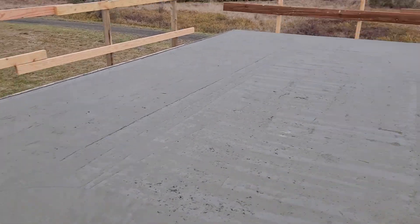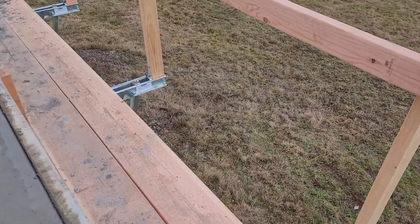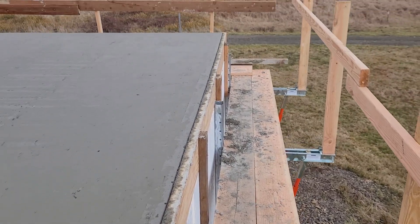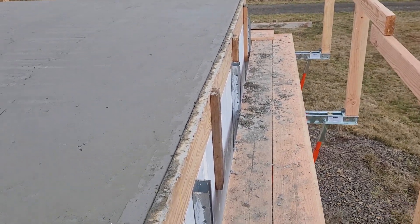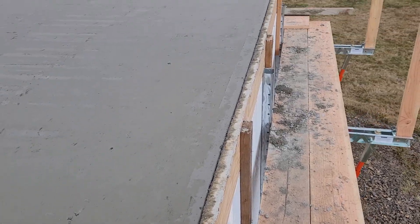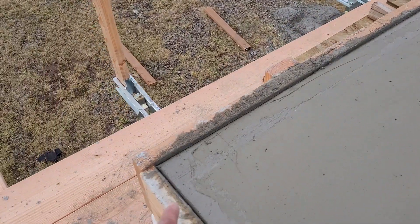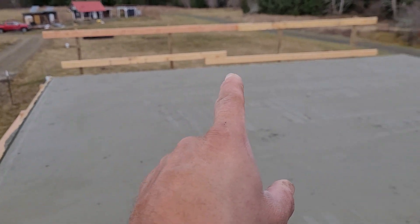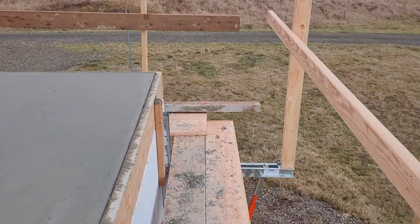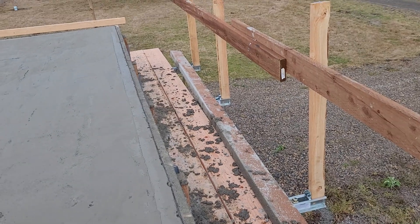Anyway, it is about 17 foot by 17 foot, and this is the roof of a utility building that we are building here. We're using the Build Brace system — we just put some four-foot two-by-fours on the outside to hold this up. This is an eight-inch slab, that's what the engineer wanted. We gave it nine inches on one end, sloped it down to eight inches, and used this massive 20-foot piece of lumber to screed the top.